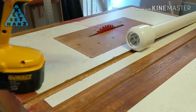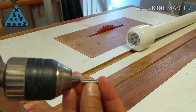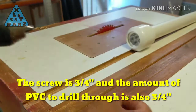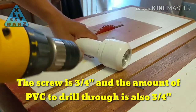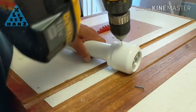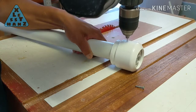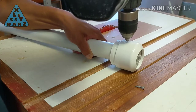To not drill into the aluminum bulb housing, insert the drill bit far enough into the drill so that the amount of bit sticking out is only enough to drill through the layers of PVC. It's best to be short on the first drilling, then slide the bit out slightly and drill into the same hole again until you see a slight bulge on the inner wall of the PVC pipe. Also, the hole should be drilled where it will be at about the middle of the reducer for the bulb housing.